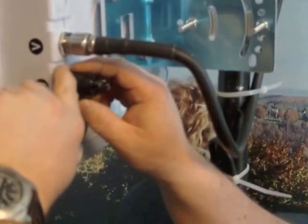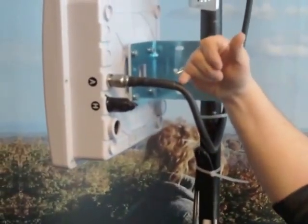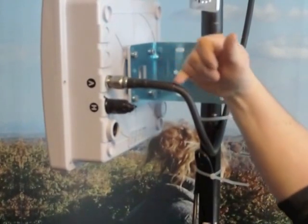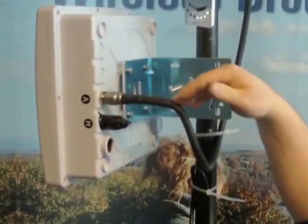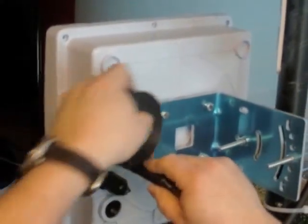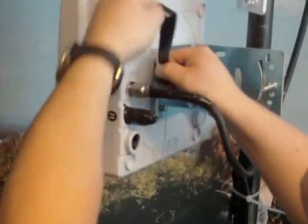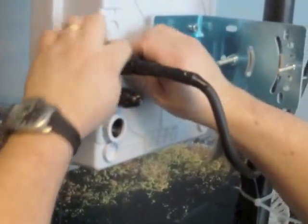We want to overlap onto the radio to make sure the connector is entirely encased. We'll do the same for the one with the actual RF cable, starting back where it actually begins to bend down away from the radio to make sure the entire thing is encased and the water has a good chance to come down here instead of leaking back towards the radio. Better to have too much than not enough — get that overlap all the way around the connector right onto the radio itself.